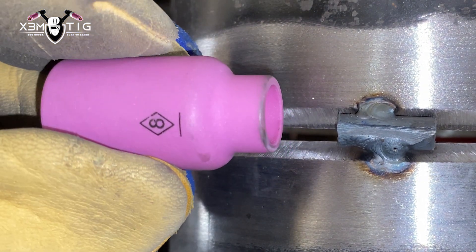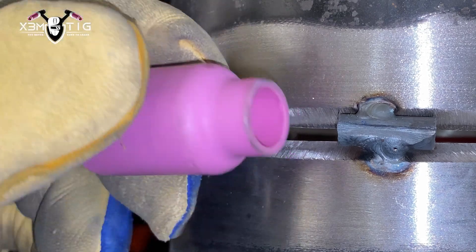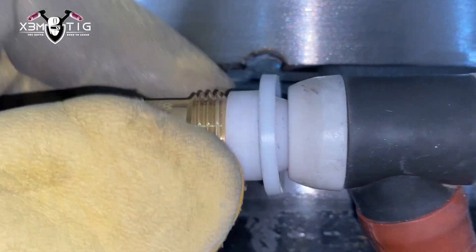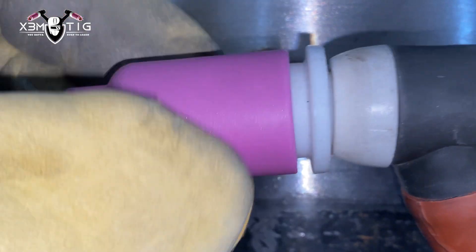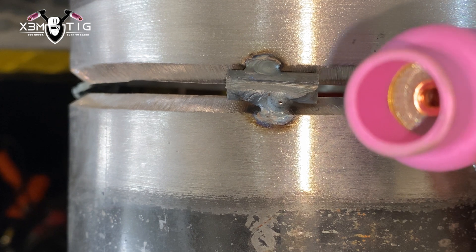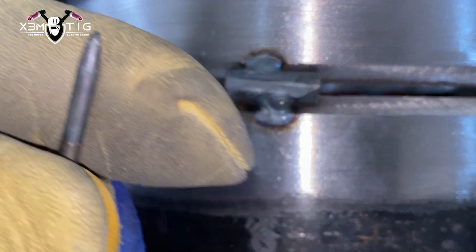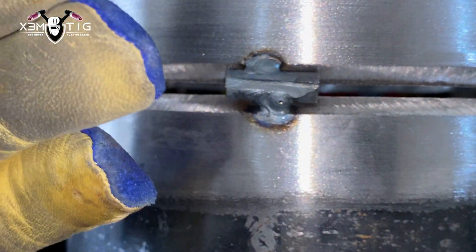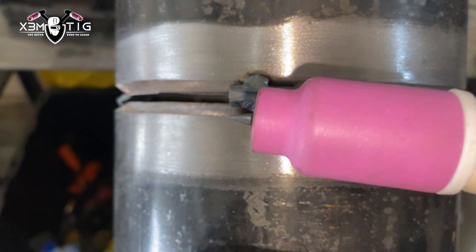Sometimes you want to get into a tight spot and there's not much room — there's always some obstacle that can make a big difference. Once you check all parts and everything is good, check your torch for any gas leaks, make sure everything works. Get ready for welding — these are major steps a lot of people ignore. Always check your tungsten: it's gotta have a sharp point. This one is a little contaminated — that's only for educational purposes. Stick out up to 10mm, or depends; I like to use the edge inside the bevel as a reference.